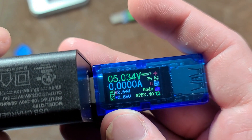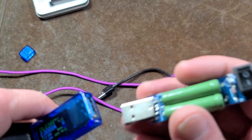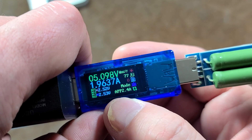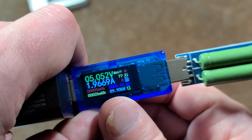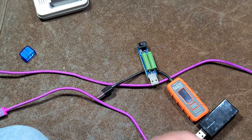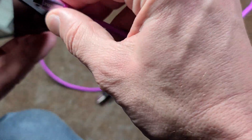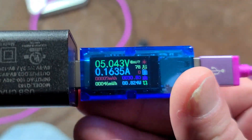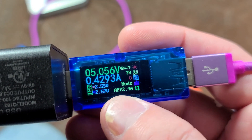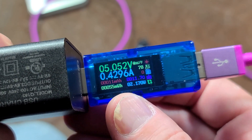The yellow looks awfully close to the green — that's what I mean by the blue tint. So this thing is pretty neat. For instance, if we plug in the dangerous little load cell here, it immediately jumps up. It did change — it went from DCP back to Apple — and that's really what this thing does. It takes in just a bit more information. Let's plug in something safer, like an actual cell phone. We'll plug in a Samsung to see if it figures out we're using a Samsung. I have this set to short charge and it's interesting — this quick charge detection mode doesn't quite work perfectly because it still says Apple — but nonetheless it's a neat idea.